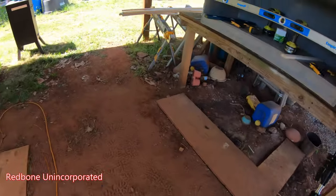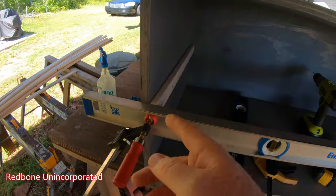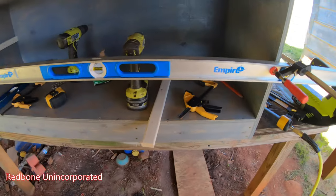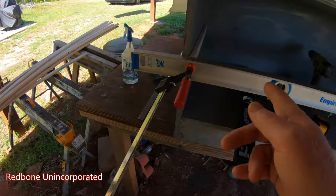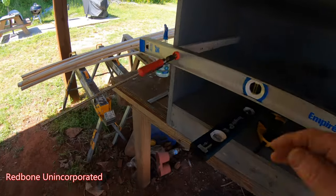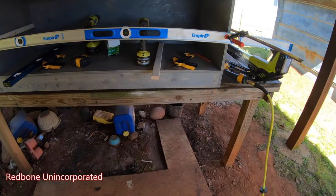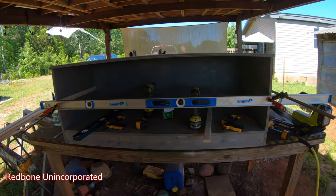Next day, working on this one. I was just about to start putting the trim on, and then I was like, hey, you've got to put a shelf in. So I got this one in, measured at the halfway point. I considered putting in two shelves, but I think there'll be plenty with just one. I was trying to figure out how to get the other side level, then I remembered my big clamps — so I just clamped my long level on. I'm on bubble, so now I can mark it out, flush with the top. I'm going to put a cleat, a long one, across the back, and as long as it's even with these it should be level. It's just holding shoes and it's three-quarter inch ply, so I think that'll be sufficient.